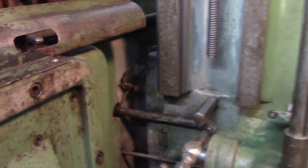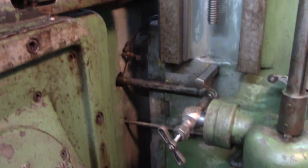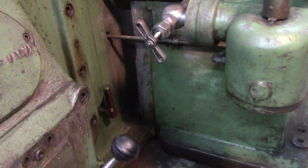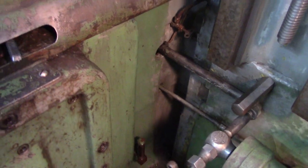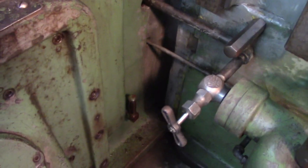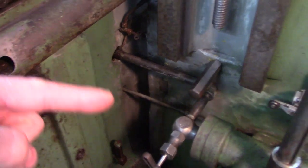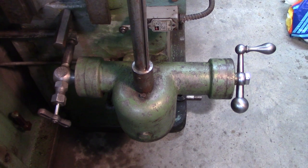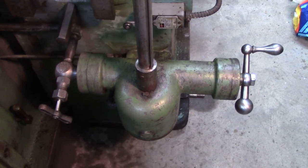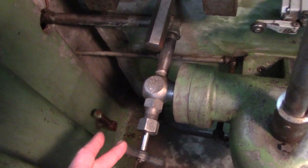Where that plumbing goes in and out — that area is where the column affixes to the base. That was pretty cruddy. I packed rags on the bottom and cleaned it with lacquer thinner and a brush, so that worked out well. That piece of hex stock is just a stop bar to keep it from going down any further. This mechanism with the hand crank — I replaced the crank in another video — this controls the step over of the tool.